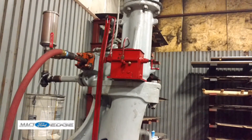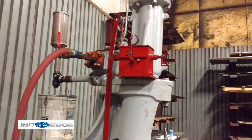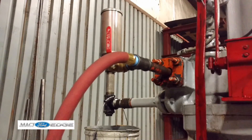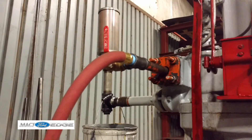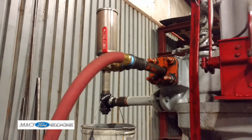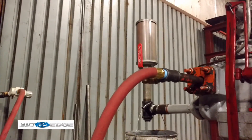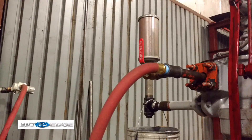So how much oil does this thing use at any given time? Well, not a whole lot — maybe a quart every eight hours, or not even that. How many PSI does this thing handle? Right now it's about 95. It doesn't use high pressure — it uses a high volume of air. That's why you've got the large air feed to it. It's a one-and-a-quarter inch line that feeds down to the regulator, and then it necks down to one inch going right into it.